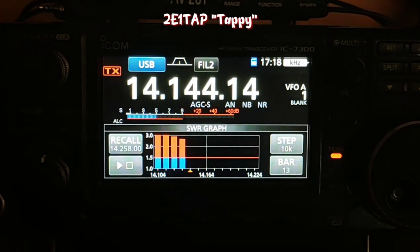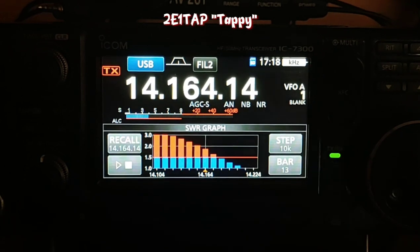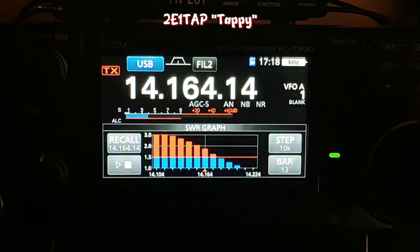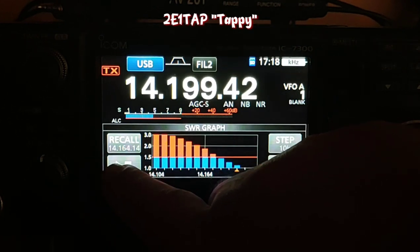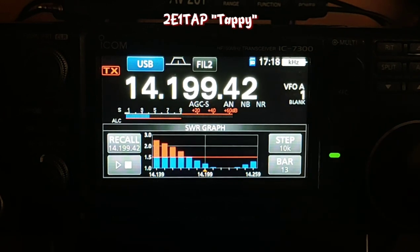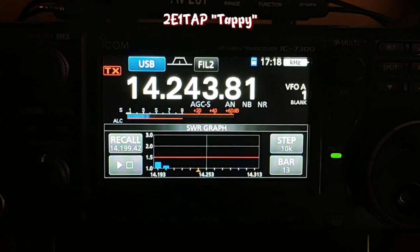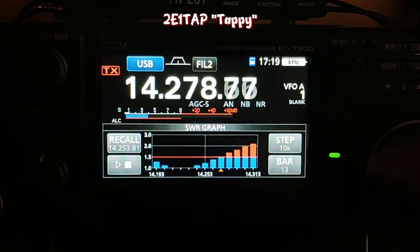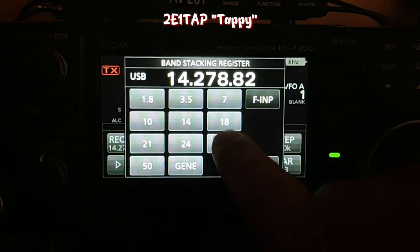The tune's off, so here we go. As you can see at around about 100, it looks — it's quite high. But the reason for that is I've got it set mainly for the voice section. I can get it down in the data should I need it, that's not a problem. I prefer the SWR optimised for the voice section. It may need a little bit more tweaking but nothing major — it's perfect for me. At 313 it starts to raise above 2, but again it's nothing that the tuner can't bring in. So there you have it, that's 20 metres.